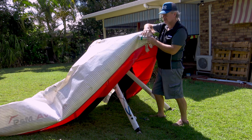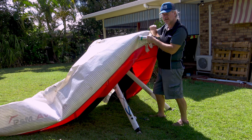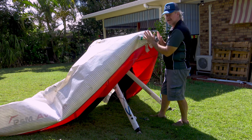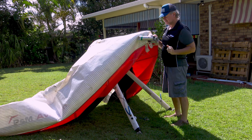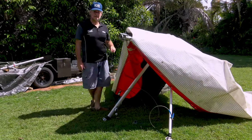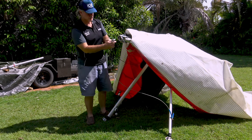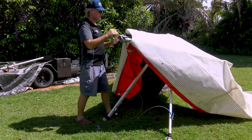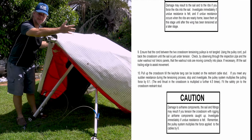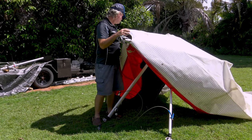These are under maximum tension when folded. The tension is greater folded than when unfolded, because when it's folded the fabric is trying to pull back. But when it's flying, the angle of the leading edge tubes makes the wing want to stay up the front. So that's the next step — the top rib, the center one, the hardest to get in. Then with the wing now half extended out, we've got everything assembled, the swan catch in there, everything's good. We've got the wing stretched out, the screws back in. What we have to do now is slacken the wing tension about halfway so that we can put the top battens — the ribs — into the wing pockets.